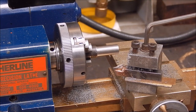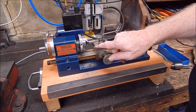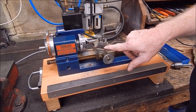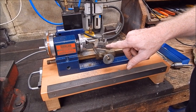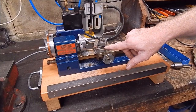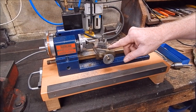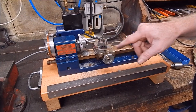That's pretty good going. All right, well, wasn't that impressive? The carbide bonded beautifully with the copper, and that's just on bare ungalvanized steel. A couple of people in the previous video I did, where I showed how you could braze using copper wire as filler, said it's combining with the galvanizing on the metal and making brass. I thought that was bullshit myself. But anyway, everyone's entitled to their own opinion. As you can see, this has worked perfectly well.